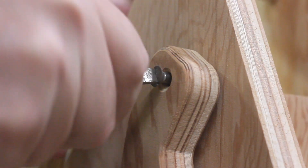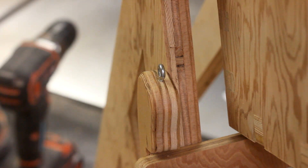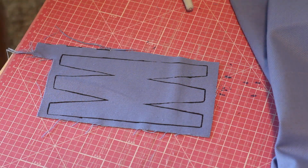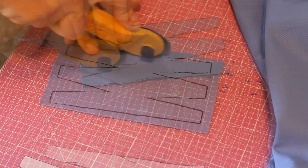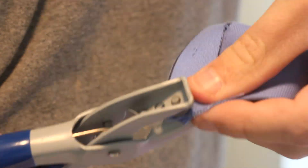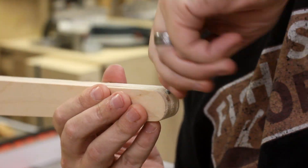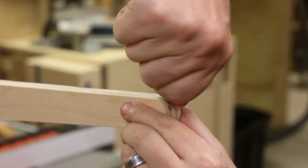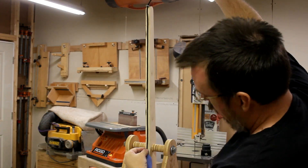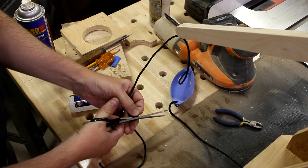And just because it drives some of you nuts, I chose to use the ugliest and nastiest flathead screw that I could find. Putting in a small eye screw for the pull string. And now I get to recall my 5th grade home economics skills so that I can cut out and make a pouch for the trebuchet sling. I used a canvas-like material and then crimped on some grommets on either side. So I add another eye screw to the end of the swing arm and then start to measure things out. The length needs to be the same as the long end of the arm, so I just threaded some paracord through and knotted it in the correct spots. Then I just cut off any excess and burn the ends because I'm a pyromaniac.